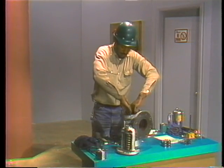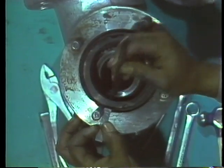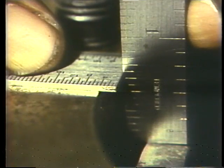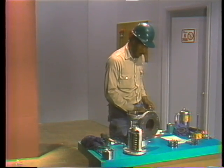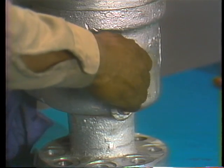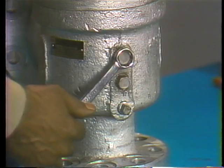The ring is still too close to the top of the valve body. Positioning the upper ring is largely a matter of trial and error, but no matter how many tries it takes, don't settle for a near miss — installing the ring in its original position is essential for reliable operation of the valve. Bullseye: five-eighths of an inch exactly. To keep the upper ring in place, he installs the upper adjusting ring pin. As with the lower pin, he first lubricates the threads, then inserts the pin as far as it will go into the valve body and uses a wrench to tighten the pin into the notches on the ring.